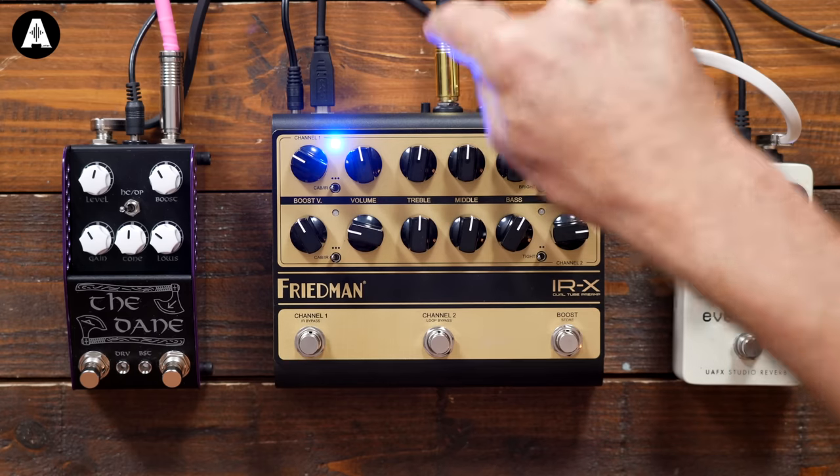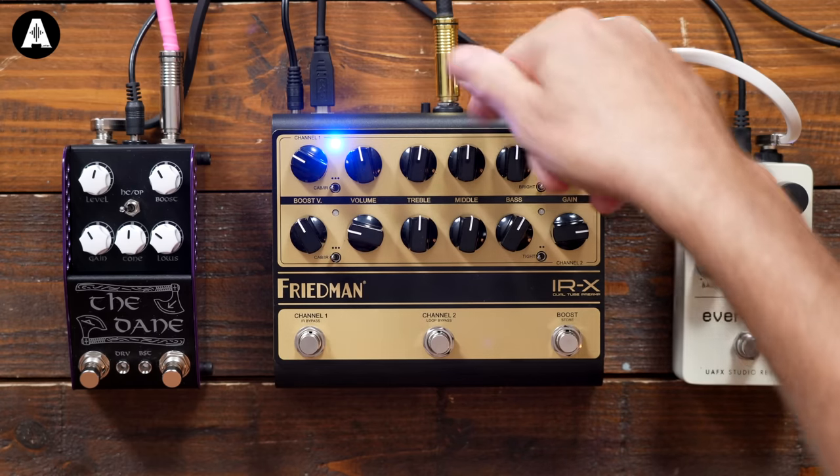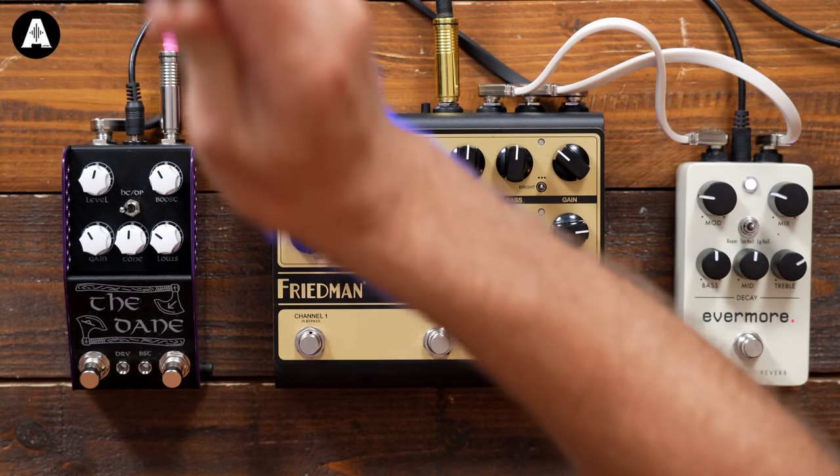I did have a little play last night when I set it up. I couldn't stop. So what I've done now, I think there's two ways that you could connect this. All I've done is use the same output that we were using to go into the DI, but I'm just using a regular guitar cable, as opposed to a TRS style balanced cable, into the effects return of Pete's DP40. So we're just going straight into the power section of the DP40. The reverb still works.